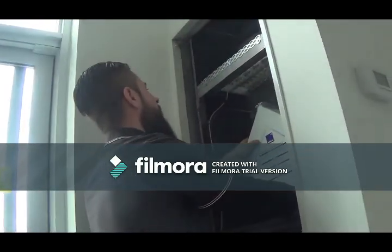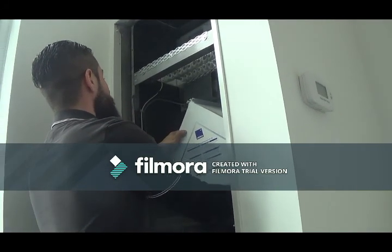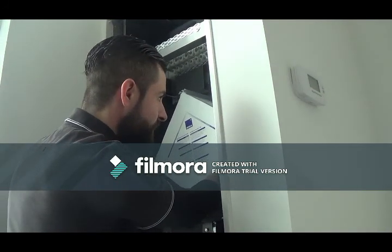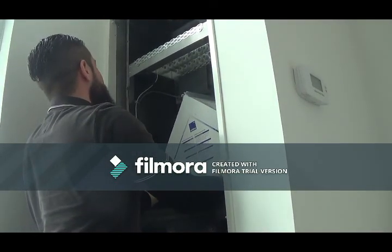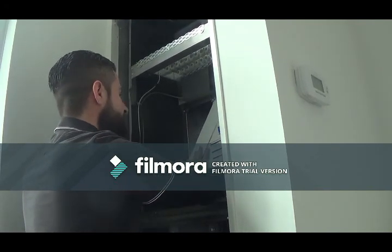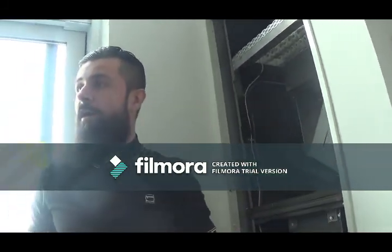The fan coil filters, obviously, you can change four times a year if you like. Or if you're not doing heavy construction, you could probably get away with twice. But I would say the other underlying issue here is that you have a fan that's running 24/7. So the chances of your filters getting plugged, it's going to occur a lot faster. Typically, where you have a unit that turns off for a few hours during the day, it's not pulling in the air.